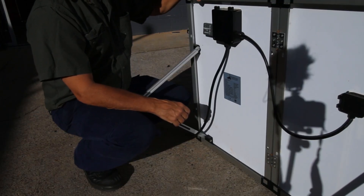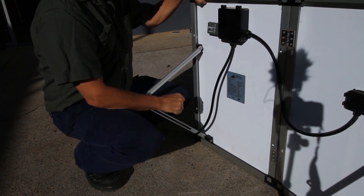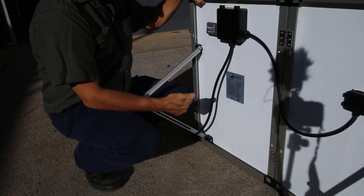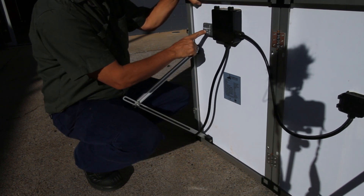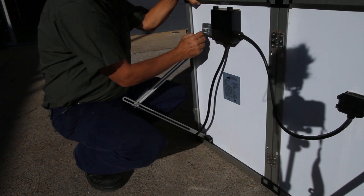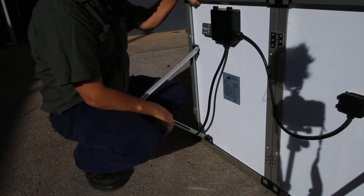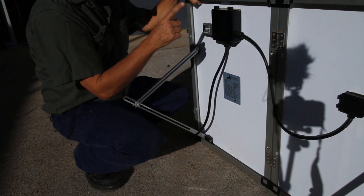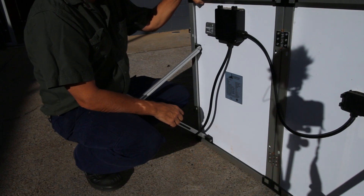If you're supplying your own solar panel, it's very important to have a regulator. The regulator regulates the charge going into the batteries, making sure you're getting the right voltage and not overcharging them. This is a little Morningstar regulator on the back of this panel. It's not mounted to the panel itself, so it stays cool, which improves efficiency. If your solar panel doesn't have a regulator, you cannot connect it to the batteries unless it's an emergency and you just need to get out of trouble.